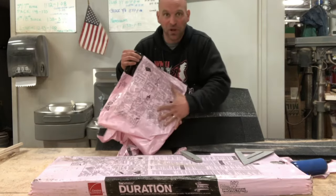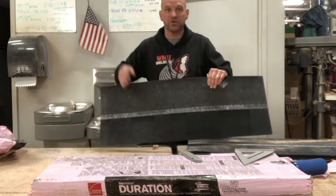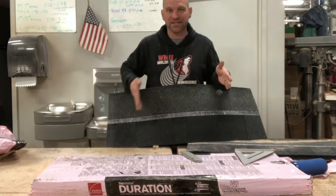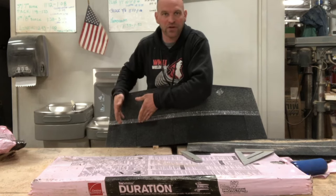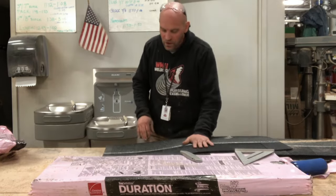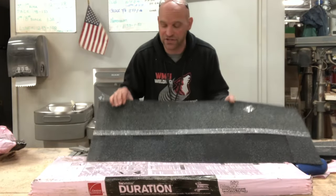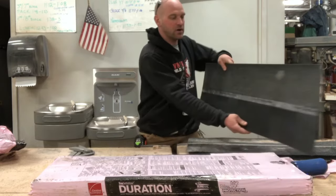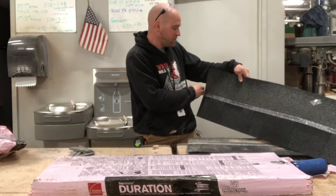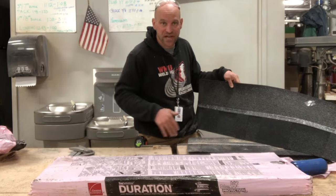This plan will tell you exactly what I'm going to tell you. What you do when you start shingles is you stagger them. Whether you start on the left or the right, you can do the same thing — one piece will be your starter, the other will be your finisher. On this Owens Corning, you have a stagger of six and a half inches. So I'm going to start my roof edge on the left side. I'm going to measure over six and a half inches and cut it off — that's going to be my first stair-step starter.